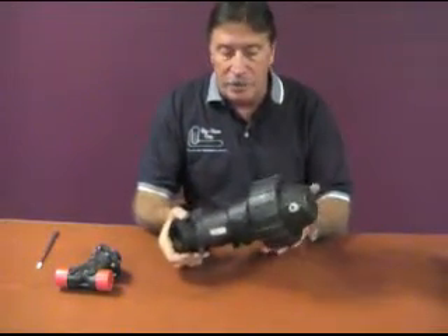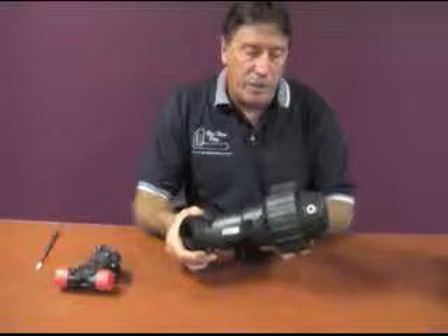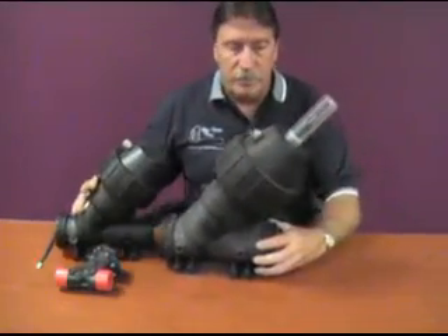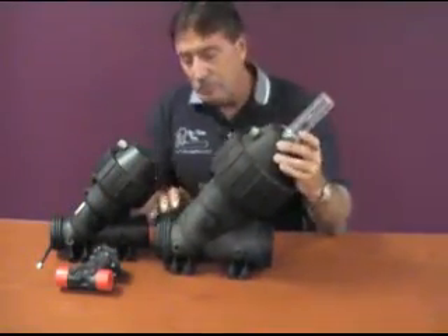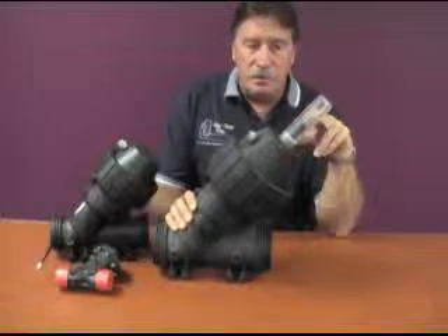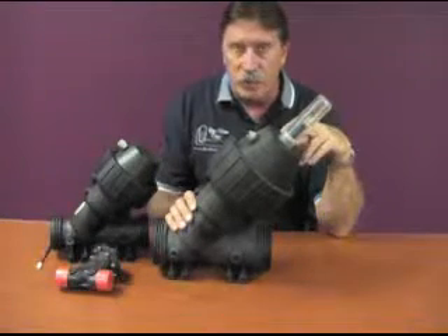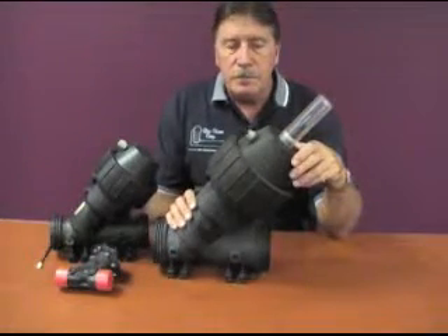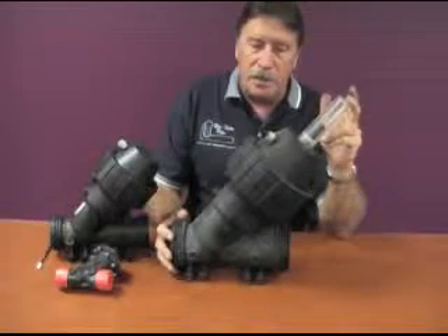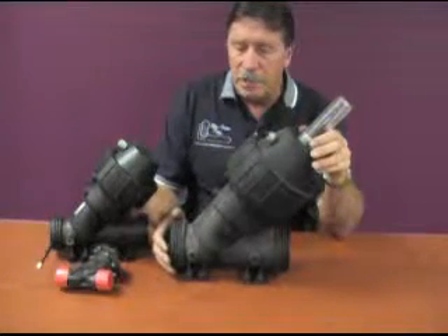As this valve looks, typically this would be a standard normally open valve — it could have a spring in it or may not, but I'd have to look at the part number. Here we have a larger valve. This one didn't come with a tag — it's an older valve — but it has a position indicator and limit stop, so you can limit how far the valve opens and it lets you know whether the valve is open or closed. Newer valves have identification that tells you if it has these features, whether it's spring-loaded open, spring-loaded closed, or fail-safe — there are any number of options available.